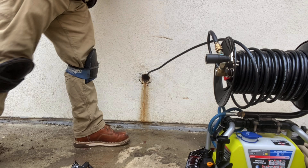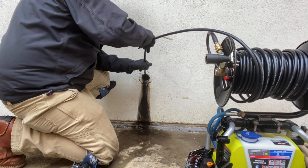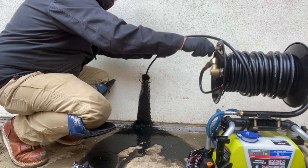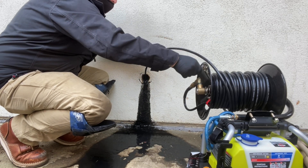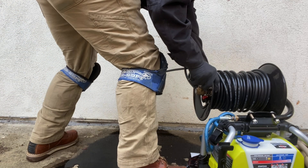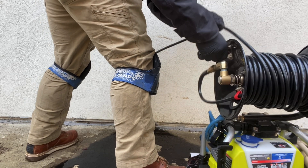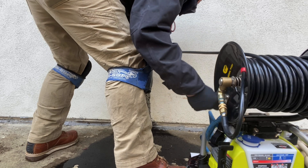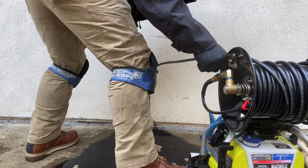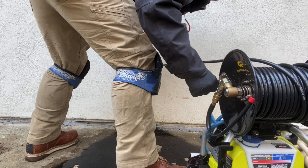The cast iron — there was no way it was budging at all. I poured Dawn soap down, did all kinds of everything I could think of. I shot my 100 down trying to break it loose, but nothing would do it. So I went and bought this little Ryobi 1900 PSI, 1.2 gallons per minute electric pressure washer and converted it into a makeshift jetter. I took my three-eighths reel off of my big cart jetter and mounted it on this little electric pressure washer.